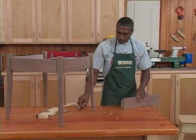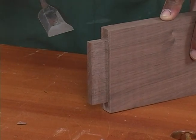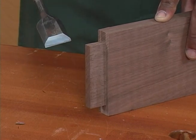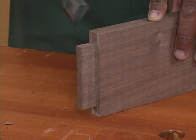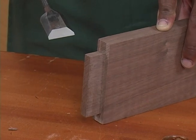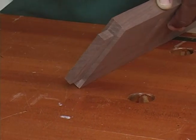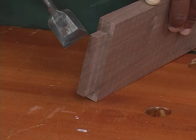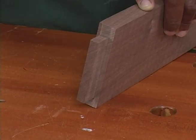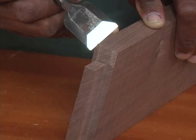You can use a hard block of wood with a piece of sandpaper or a finely set shoulder plane, but my tool of choice for this next part is a sharp chisel. We've got to pay attention to three areas: the shoulder of the tenon where it meets the edge of the stock that the tenon is milled into, the apex between the edge of the tenon and the cheek of the tenon on this corner here, and the end of the tenon where the edge and the end come together. All we do is take a chisel — or a fine cutting rasp or woodworking file — and just back-bevel that a little bit, just a small chamfer.